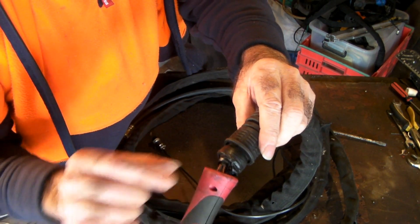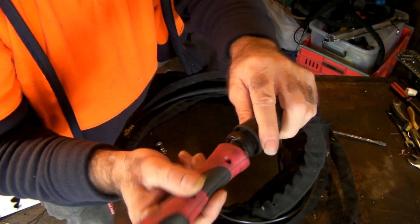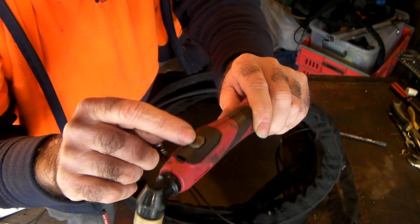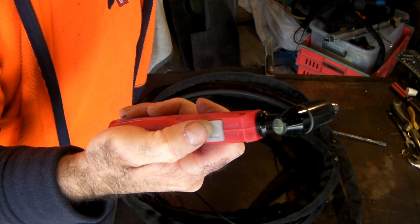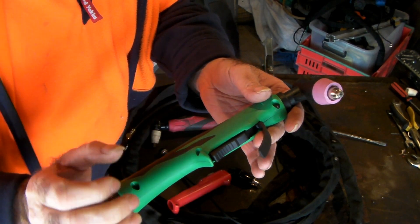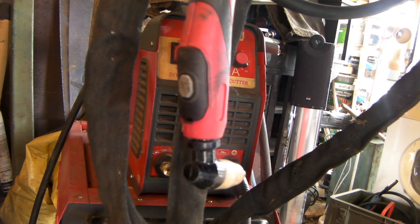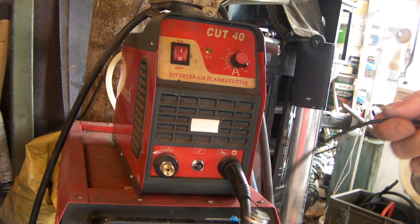On the other end of these - this one here has been knocked around something wicked - the wires will break in here as well because it's moving all the time. The wires will break in the actual switch and sometimes even the little circuit board in the switch will malfunction. Doesn't matter if you've got a switch like this or even a switch like this, it's the same thing - it'll burn the little circuit board out. Sometimes even if you're using something with the trigger underneath, they'll burn out as well. So just watch those little things guys, because it can be a real hassle when you think your machine's broken but it isn't.